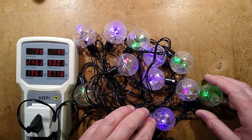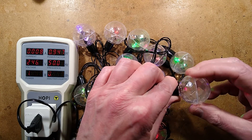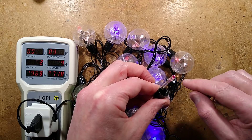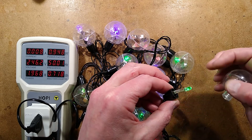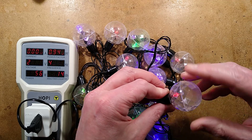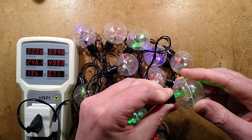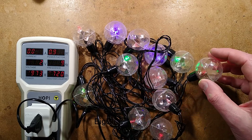The reason I bought these lights is I was quite taken by the covers, and it's nicer still that you can unscrew these caps - they can be reused. Inside is the classic mains voltage style light: it's got a little resistor in series, six of the caps, and then a focused LED on the end that shines through this sort of slightly grubby-looking plastic. It's not a nice finish, but it projects that pattern - it's okay, in a dark room it's not too bad.